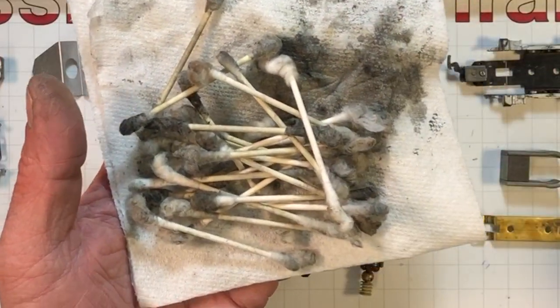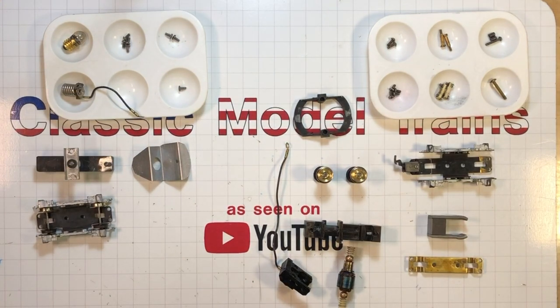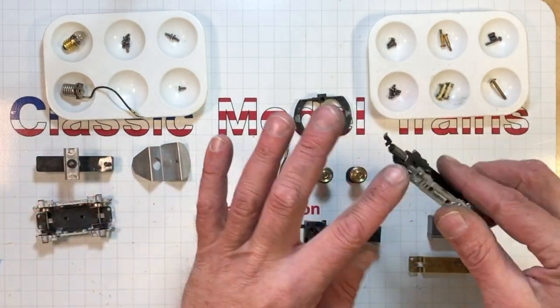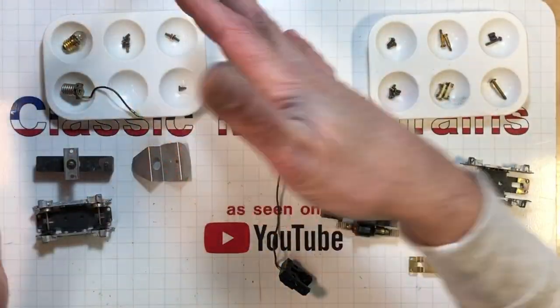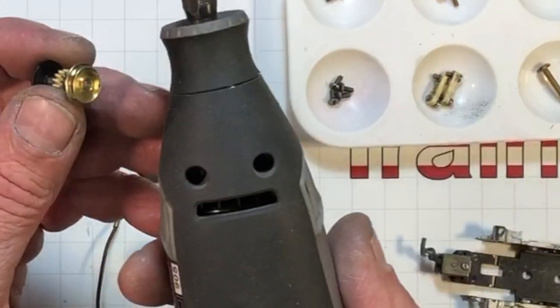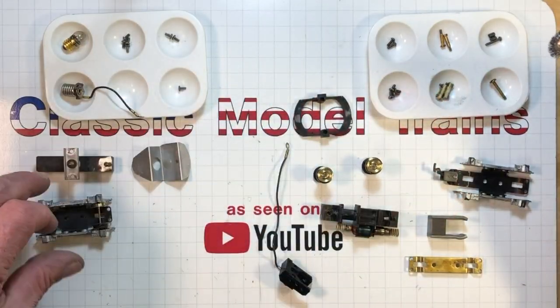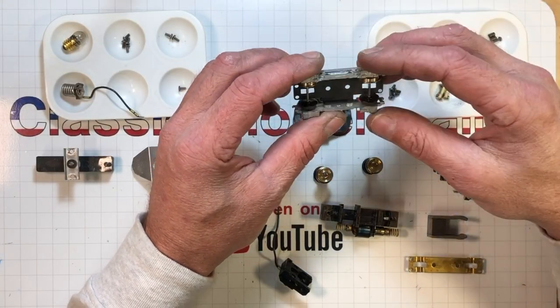After about an hour of digging around we finally got her whipped into shape and clean enough to put back together. It was oiled back in the day but then nobody oiled it for many, many years. Q-tips and odorless mineral spirits — cleaned up all the pieces and parts: motor frames, commutator still to polish, brushes, screws, front end, rear end. A lot of parts. Now these little wheels are thinner than modern ones, so I used the Dremel with the little wire wheel to really go after them.